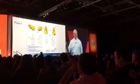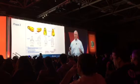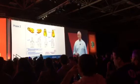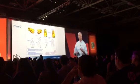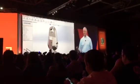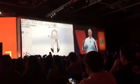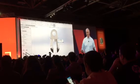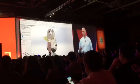As I mentioned before, those ledges at the top go from planar to cylindrical, and the ceiling at the bottom, if you will, inside of that pocket becomes spherical. When I look at this, the first thing I think of, replace face. Maybe you don't think of that, but maybe after I go through this little exercise, you'll say, next time, that's what I'll think of too. So instead of having to delete geometry or recreate geometry or add material, remove material, which might force some of my other features to fail or become dangling, I'm just going to use the replace face option, one of our many tools that we have for direct editing.